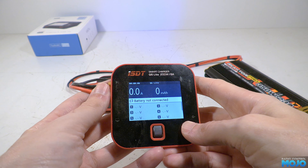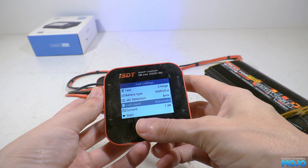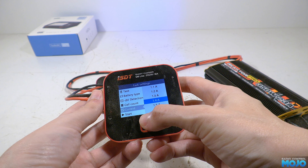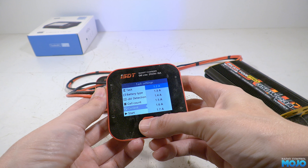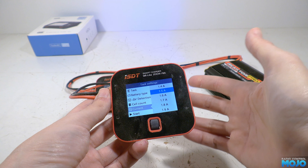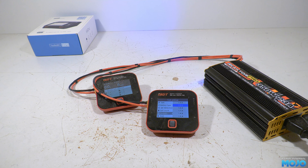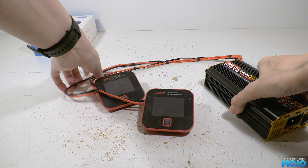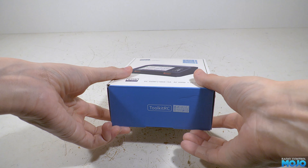That one thing has made them pretty much unusable. If we power them up and go into one of the menus, you can see the scroll wheel is extremely jumpy — it pretty much just comes down to luck whether you can highlight the item you want, which is more than a little bit annoying. The issue is the rotary encoder; the thumb wheels just aren't very good. I've cleaned them up many times, which has had them working for a few hours, but then they start getting jumpy again. I thought about replacing the encoders but it's just not worth the bother.